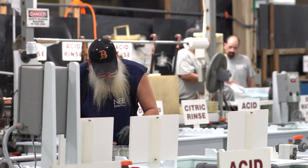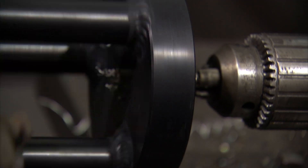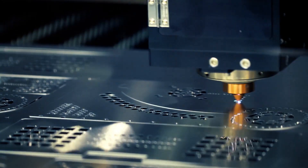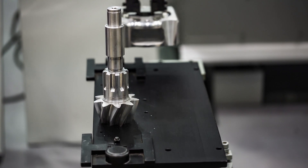One of the reasons that our customers electropolish is to make sure that parts are passive. Even though stainless steel is inherently passive, in the forming process impurities are embedded into the surface of the material, and those are the areas where corrosion will build over time.